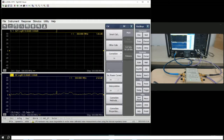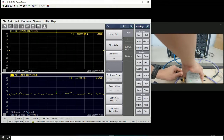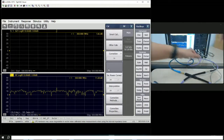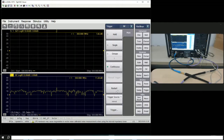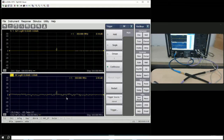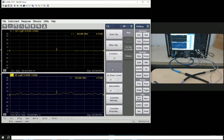Calibration is done. I'm going to connect the device under test, which is my cable. Let's see how it turns out against the S21 measurements. After restarting channel 2, you should get an updated reading. It looks like this cable has a 2.48 dB noise figure. The averaging will make it smoother. If you want, you can turn off the calibration correction and see how it looks before calibration. That's it for today — thanks for watching.